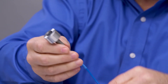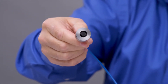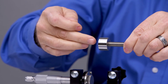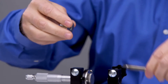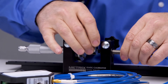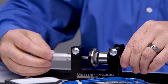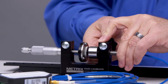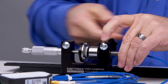What we mean by a tight view — you can see when you look at this fixture that the probe is very close to the metal on the sides. That's what we mean by tight view. So when I put it in the static calibrator, I'm not only going to have a tight view on the sides, but I'll also be measuring the gap as I move the target away from the probe. I have my micrometer set for 0 mils, and I have the probe right against it, and I'll tighten this up so the probe stays in contact with the target. This is just my initial setup.